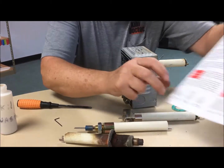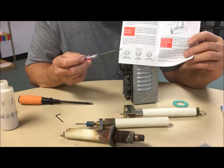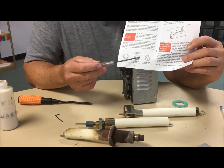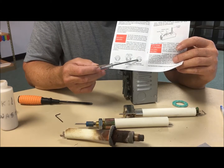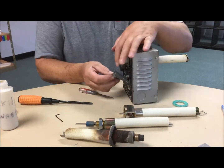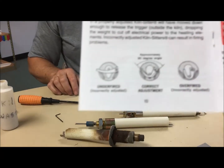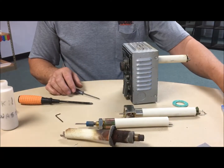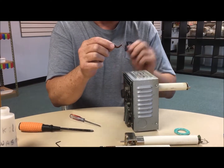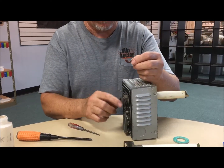This is an example of how alignment affects the cone. You have an under firing — it looks kind of like a banana bend. Your perfect bend is a 90-degree bend. An over fire is going to look more like a horseshoe bend, which is where the claw and plate is too high. You should check this every 20 or 25 firings, or when you've changed your cones out, look at them. If your cones are 90-degree bends, everything is in alignment. If they're starting to change shape — over firing or under firing — you need to come back and make an adjustment.